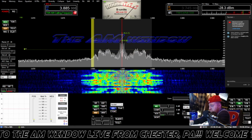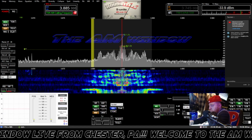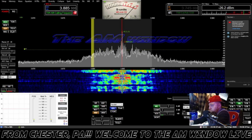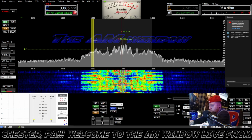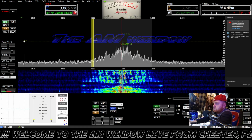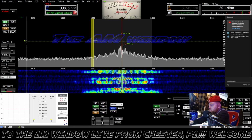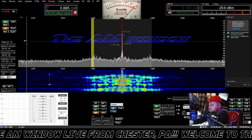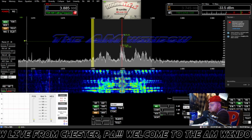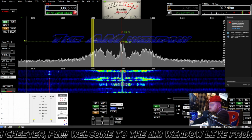My antenna is about 40 feet off the ground as well, and overall it's probably 135 feet or so. Doublet, fed with open wire line. The transmission line is like 7-inch spaced, so it's got a lot of spacing. That comes right up through my roof, through penetrations I made with flashing boots and pieces of Teflon. And that's fed from the homebrew double balance tuner. It's on my QRZ page. You can see I'm streaming right now, actually, on Twitch TV. I don't know if you've ever been on that site, but good stuff. W2BTK.